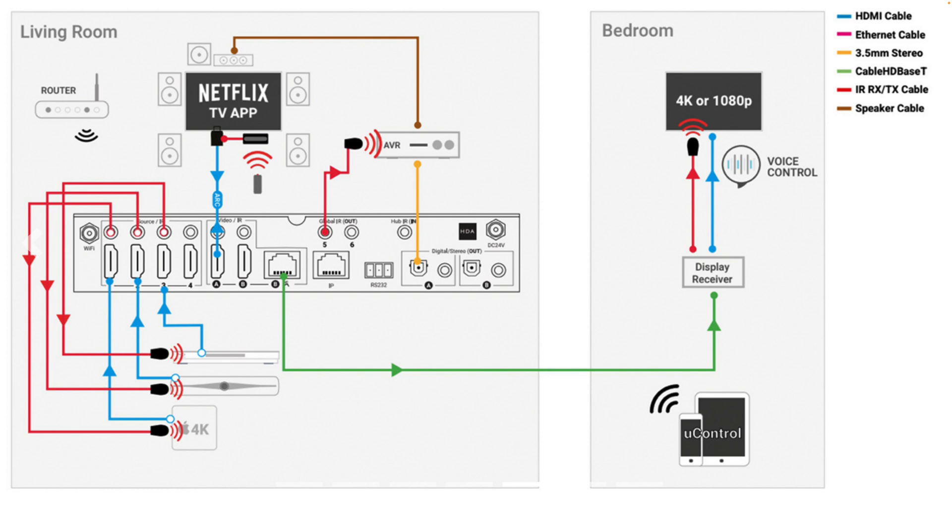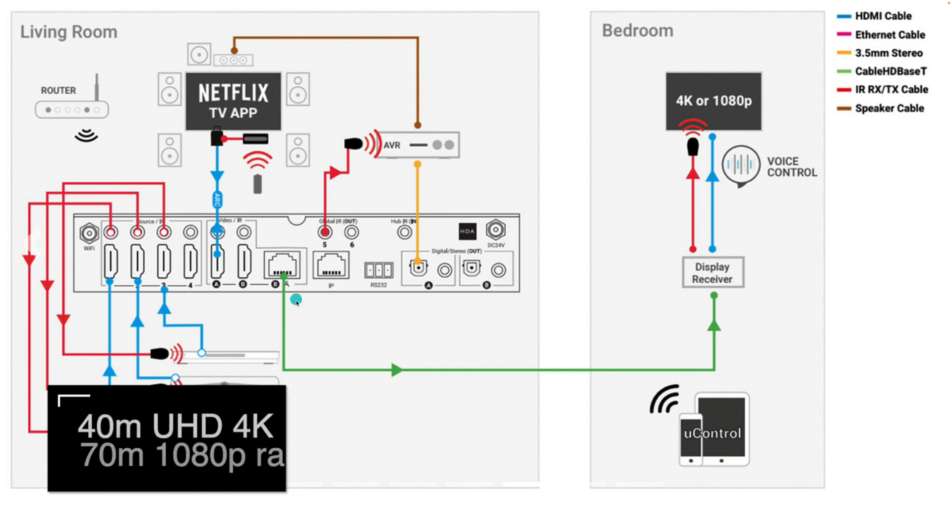Don't get these mixed up — you can't have a switch feeding into both this port and this device. It needs to be completely separate with its own run. Preferably use the best quality CAT6 or superior that you can get. But if you have a quite short run, you might get away with lower quality. Really get the best connection you can if you're wiring this up from scratch — if not, use what you have.